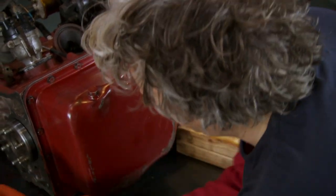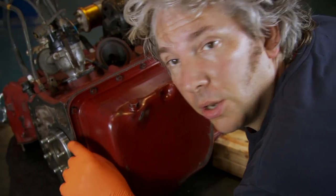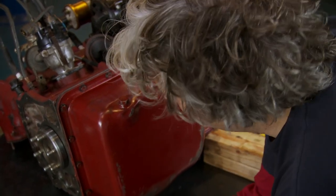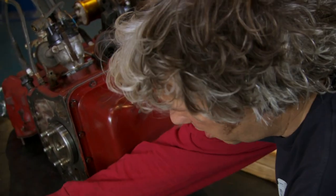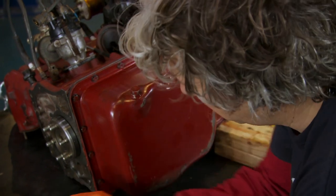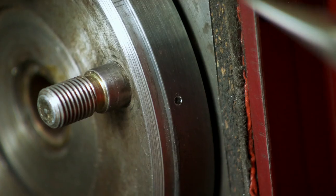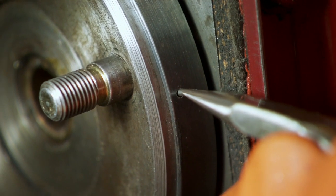Now, this is a little bit mad. I'm actually locking our slip ring onto the crankshaft flange with a little tiny roll pin so it doesn't move around and foul on the crankcase. What I've got to do now is shove that little teeny-weeny thing into this hole just here and then tap it so it's nice and flush.